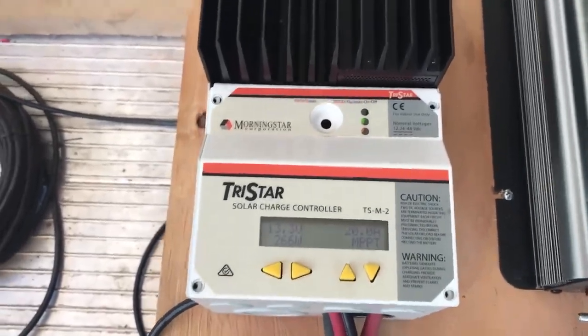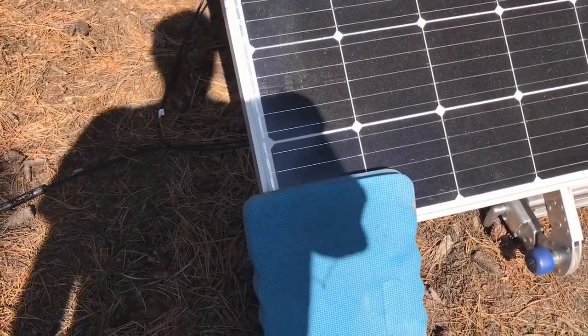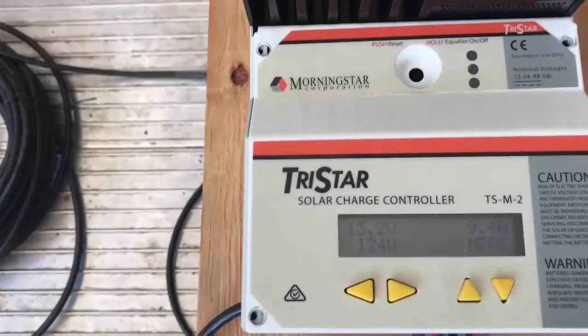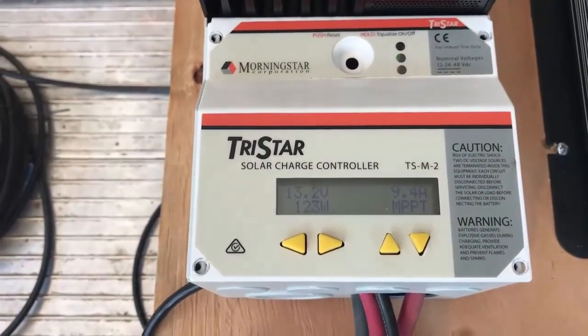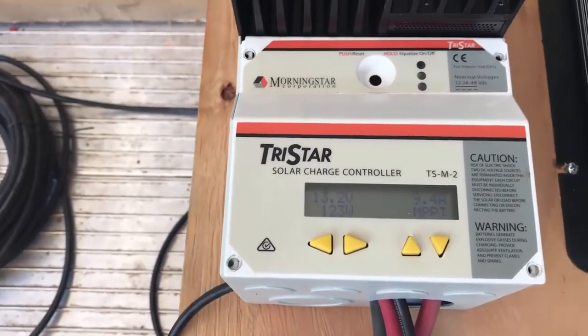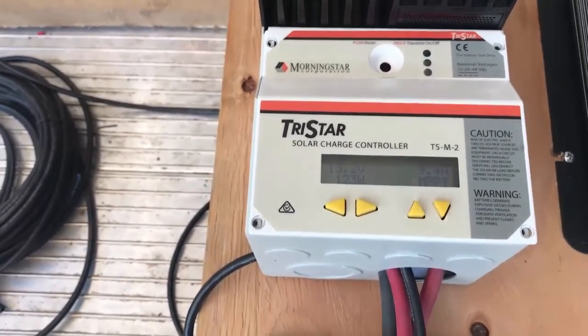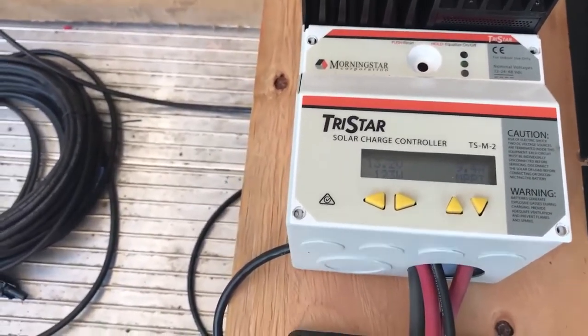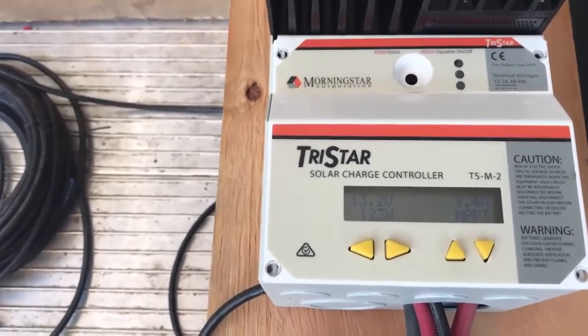Let's try to cover one of the solar cells. I just covered one cell partially — about half a cell — and I had 266 watts before. As you'll see, I get less than half the output simply by a single cell being covered. That is because all the cells are in series. If one cell can't produce as many amps, then all the other ones are limited to that level. The current is what changes here; voltage doesn't really change a lot.